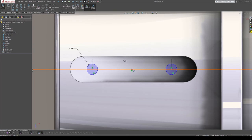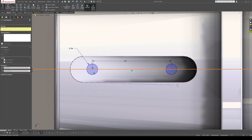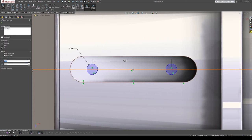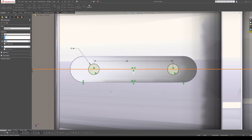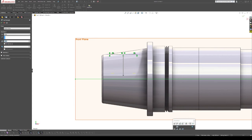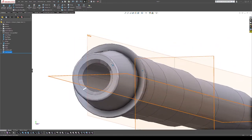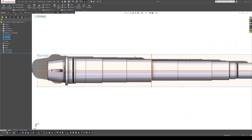I'll create a centerline and a second centerline, get the midpoints of these two circles, set them vertical to center them in the slot, then extrude those down. These only go in a short distance — a quarter inch with a little bit of clearance at the bottom, 15 thou clearance, since they don't go through to the center. Those are our tapped holes.